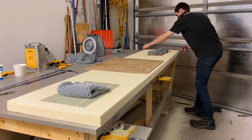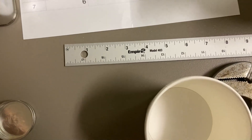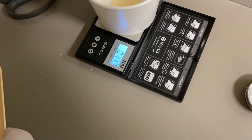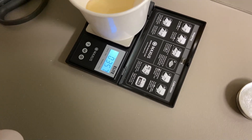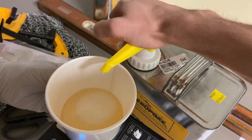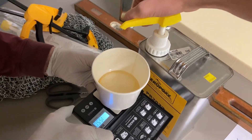This particular variety of foam is extraordinarily fragile and very easy to ding up, so I had to be very careful — even the tape measure would put indents in it, and even picking it up with my hands would do the same thing. The next step was using a table I made using the ratios called for for the epoxy hardener and resin to prepare the desired weight of epoxy for joining together a larger piece of foam and a smaller piece of foam to get the length that the plans call for. After matching the correct weight of hardener, we pump in the actual epoxy and get the weight to exactly what that table displays, or as close as it can possibly get.